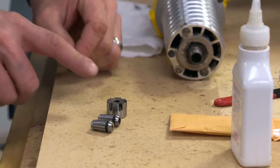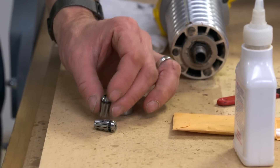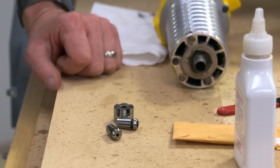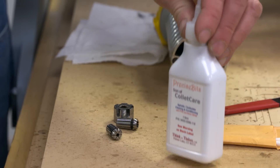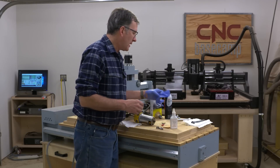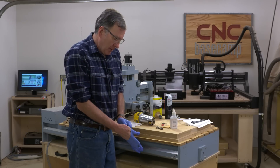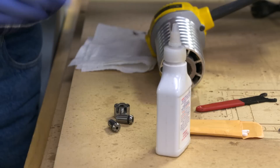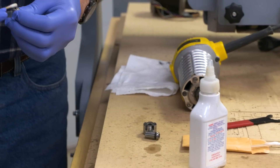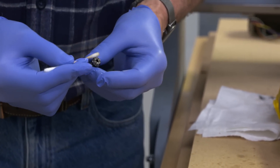First, let's begin with a little bit of collet care. The collet I have here is a precision collet, which I really recommend as an aftermarket accessory for these 1-horsepower routers. We have a collet nut, a 1/4-inch collet, and a 1/8-inch collet. It's very important to keep them clean. What came with this collet was a bit of collet care cleaner. When dealing with collets, be very careful not to score them — don't use any wire brush. I'm putting gloves on because this collet cleaner has petroleum distillates and also boron, so they recommend you don't get it on your fingers.